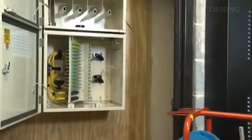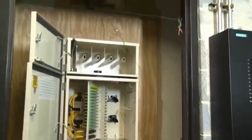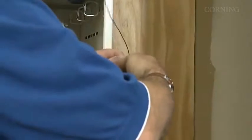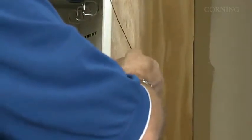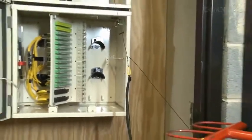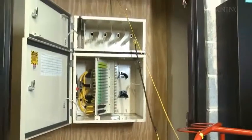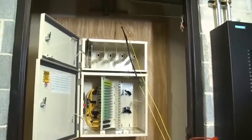An installer on the top floor will begin by pulling the line up. Once the first attachment clip appears, attach the first cable's pulling eye and close the clip completely. Depending on the number of floors, the Rapid Pass cables may be a variety of lengths in 50-foot increments and they must be placed in the correct order from longest to shortest.